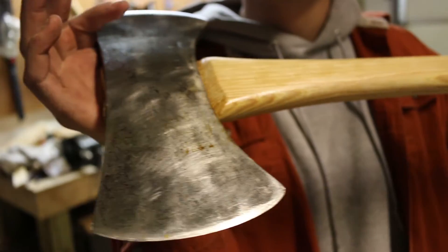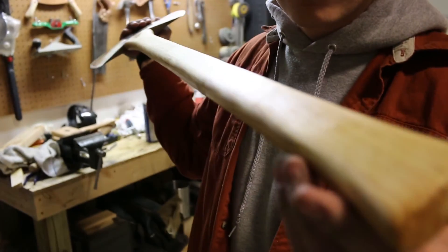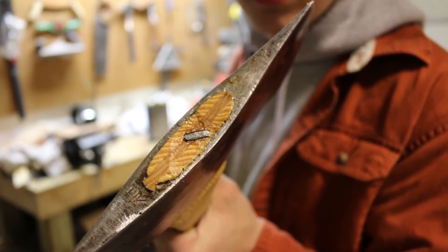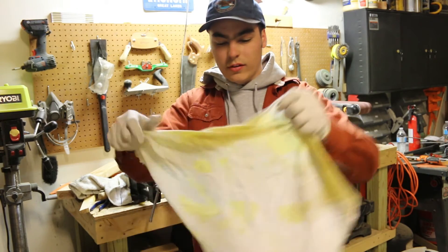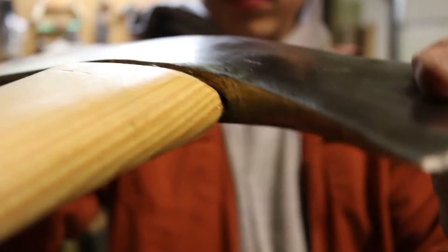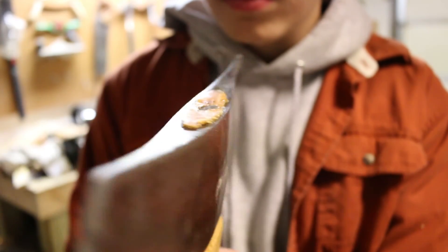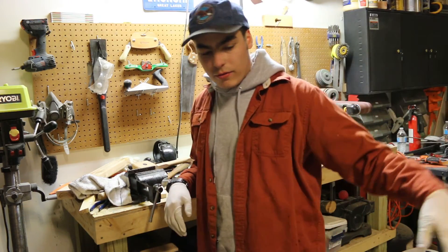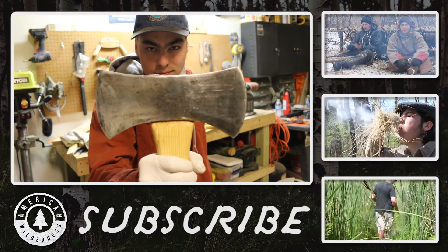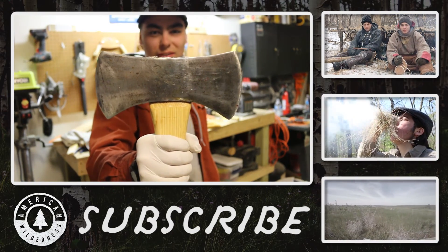I think I'm done for today. I'll definitely be going back and oiling this — once a week, then once a month, then once a year. But this is going to be the end of the video — thank you guys for sticking around. One quick safety precaution: boiled linseed oil on rags is known to spontaneously combust. I've never experienced it, but others have and it definitely happens. So if you've got a bucket of water, maybe toss the rags in there. If you've got a burn pit, toss it in there. Don't leave it on the bench, don't leave it by sawdust or anything that'll combust — it's not safe. But thank you guys for watching. This is how to hang a double bit axe on a handle. I'm Brad with American Wilderness. Thanks for watching.